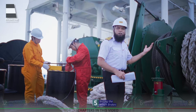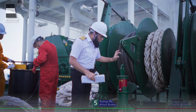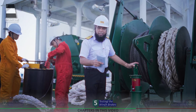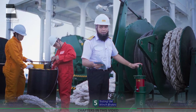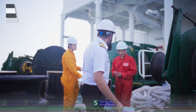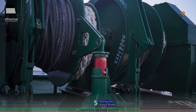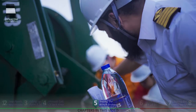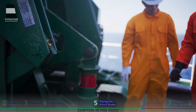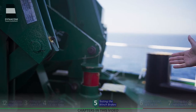Our pressure jack is already here and ready. When ready to perform the test, turn the winch a little more to bring the triangular plates so they meet with this attachment and sit firmly on the pressure jack — that is when we start tightening the brake and applying pressure. We are now aligning these holes so they sit in line. Once in line, we put the bolt. The nut and bolt is fitted, triangular plates are in place, and now we are going to attach the pressure jack.